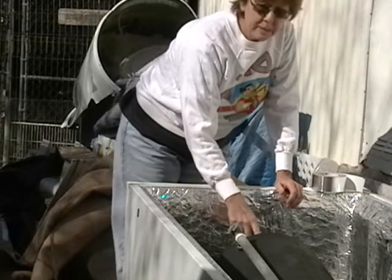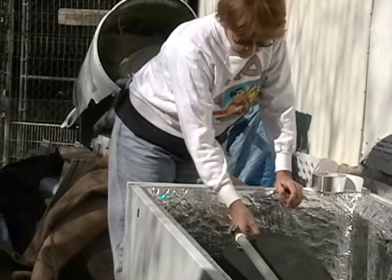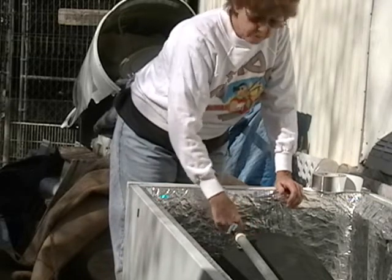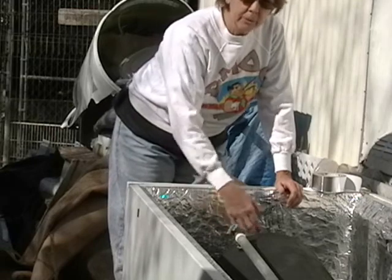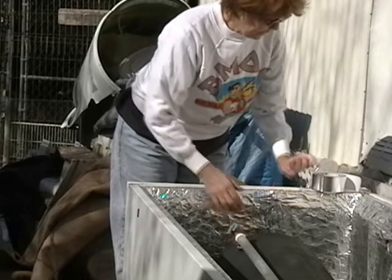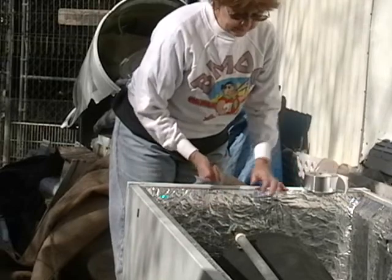We're going to take a little pipe or flashlight or stick or whatever, see where we need to drill into the wall, cut out the lining, put the reinforcing HVAC aluminum tape on there so that the keyhole saw doesn't tear it up, and then we drill.